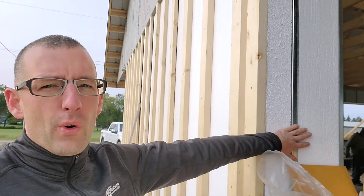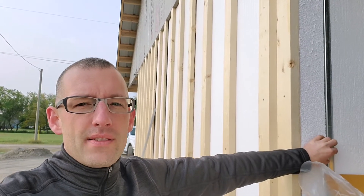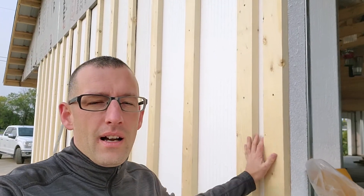Behind me you can see the detailing. On the inside of the wall you've got the nine and a quarter inch ICE panel with the steel frame on both sides, and then outside of that the four inch R panel added to it, and then the two by four strapping going around that opening — creating a nice fastening point for installing the window as well. You end up with a really thick wall, lots of insulation, and it's going to be a super efficient build.